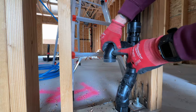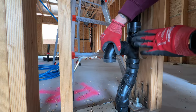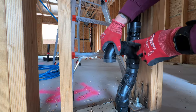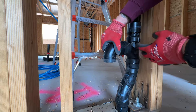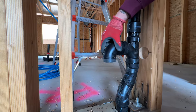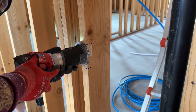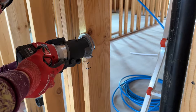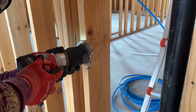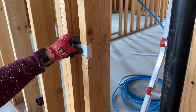You also want to make sure that you hold these joints while you're gluing them, because when you put the cement on there and let go, they'll start to push back. That cement actually dissolves a little bit of the plastic or the ABS and it will push back on itself. So if you read the instructions, it actually tells you to hold the pieces in place for about 30 seconds — then you can let go and it won't push back. Now it's not necessary to recess these brackets, but I did just take my router and remove a little bit of the wood on the studs so that it does not push on the back of the drywall when I go to hang it.